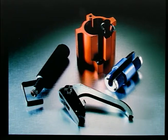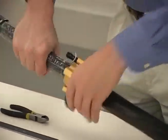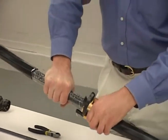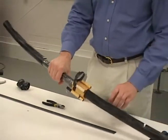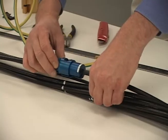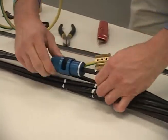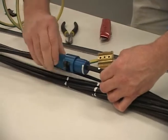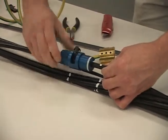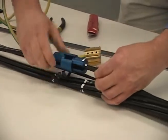The LMR Bundled Cable Tool Package has unique products designed for easy use and long life. A universal outer sheath removal tool can be used with any of our bundled cables. While working with the BC 400-7 and BC 400-9 cables, custom strip tools are available. For ground kit preparation, the GST 400-8 tool easily accomplishes the otherwise challenging task of removing the inner cable's outer jacket from the BC 400 Bundled Cable series.